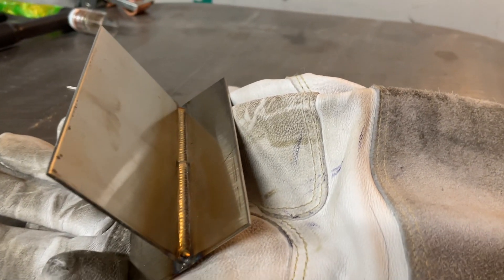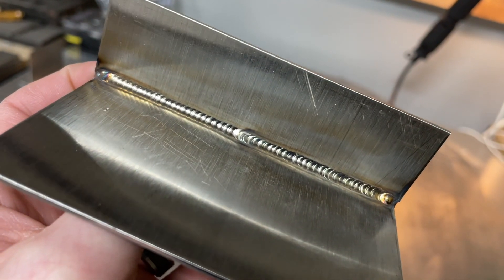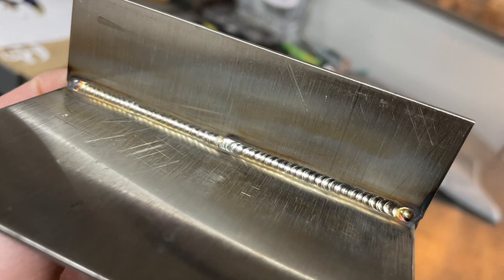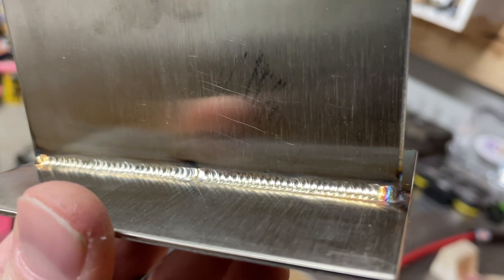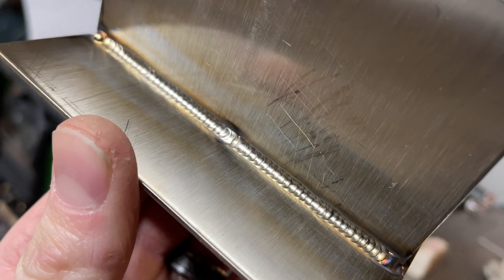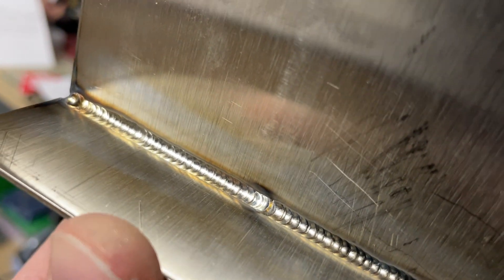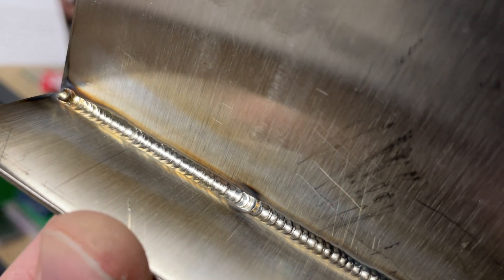Let's pick it up and take a look. Overall the finish turned out really good — I managed to keep it cool so the weld color stayed more gold than blues or purples. There's a little color oxide at the beginning where I was getting the puddle centered, but once I got rolling everything centered down and stayed pretty consistent. I probably should have used a little more filler rod. I double stuffed each step to keep it from falling too flat and getting too cool, but the tie-in was pretty good and the consistency carried through the second half. I'd rather double stuff and keep a smaller rod so my line of sight stays clear.